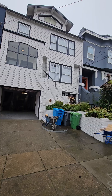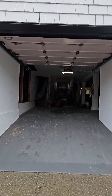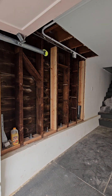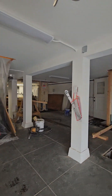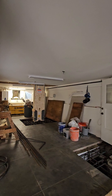We are going to add some lateral bracing. We call this our Program Two. We have two levels of retrofits typically on houses like this. Program One is where we enhance the existing walls — in other words, the walls that are already there — and reinforce them with bolts and shear walls and seismic hardware.